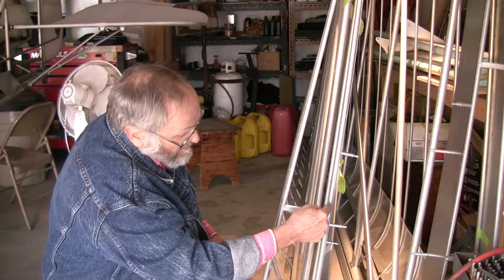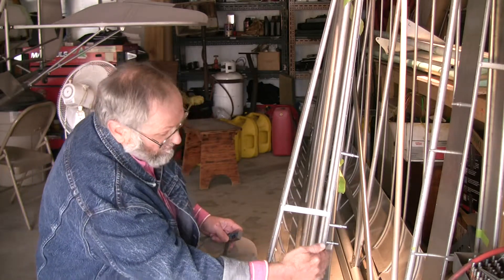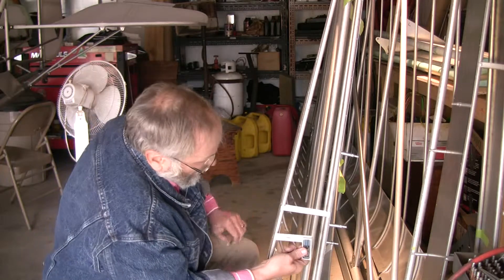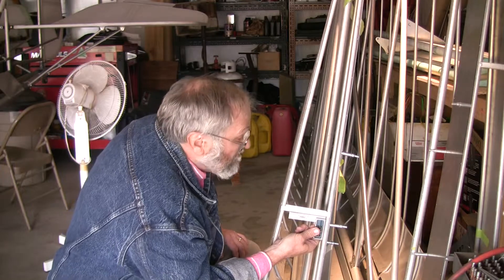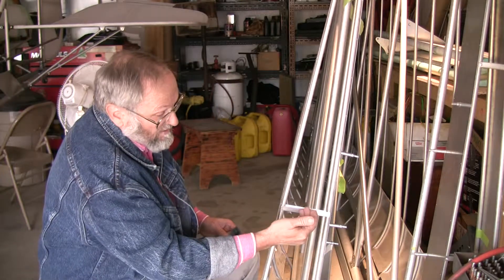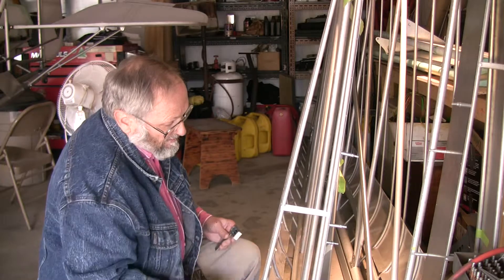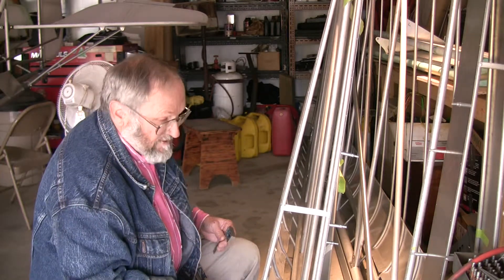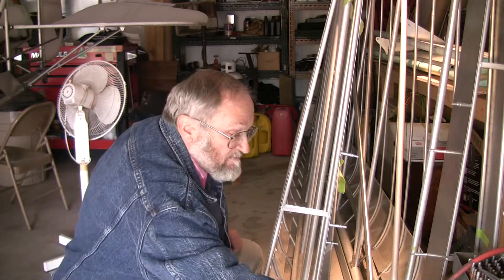You're going to want to make a centerline along the center of the bottom rib — the rib that's flat, the flat side of the wing. Take your square and put it up against that bottom rib and line those brackets up until the bottom of the U-channels just fit around the edge of the rib tubes. Now as you can see it's a little bit of an angle because the upper surface of the wing is angled. Then just take your magic marker pen.